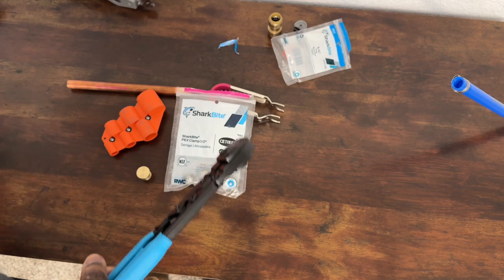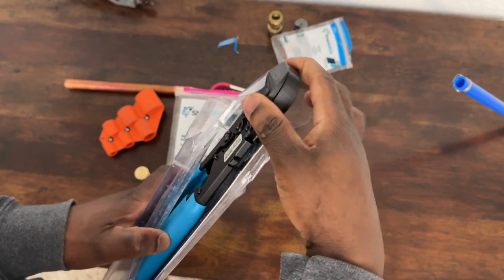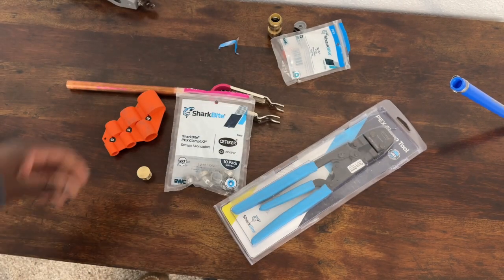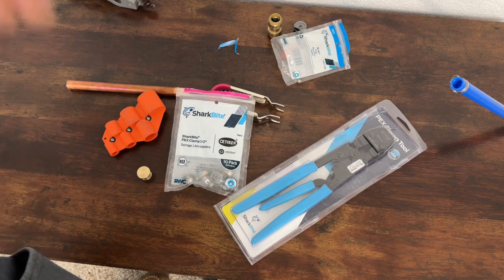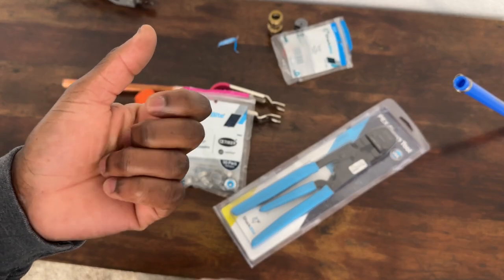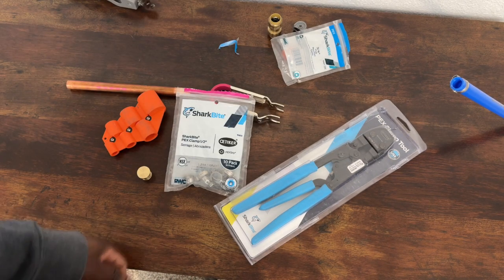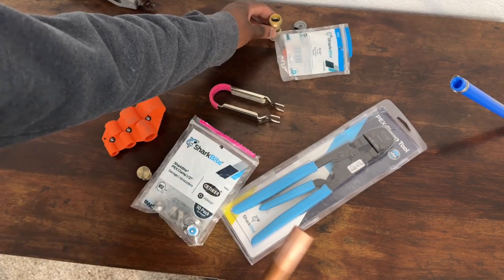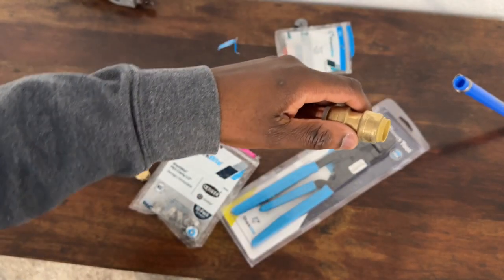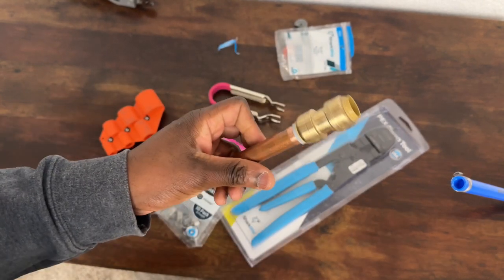I hope this helps you do your plumbing if you're scared about soldering - a lot of people don't enjoy soldering. Sometimes corners in the house are very difficult to get into, but with this crimp tool you can get into very tight corners and crimp without worrying about lighting a torch or burning wood. It's scary to use a torch to solder in some areas of the house. With copper and SharkBite, make sure the plastic insert is in place; with PEX, remove the plastic insert.